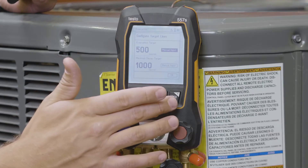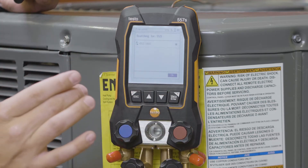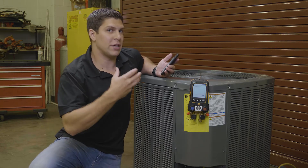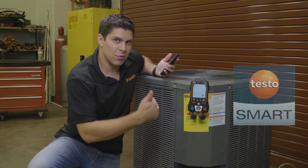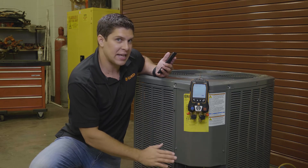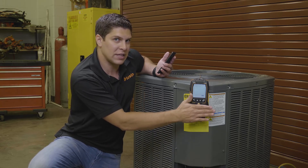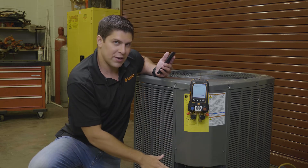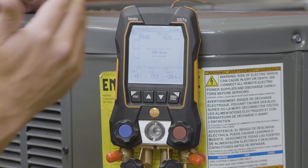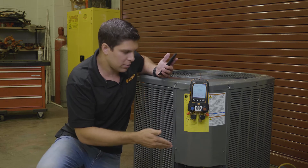So we're going to set our targets. It's going to be looking for the 552i, which you can purchase independently — it works with the other smart probes as well. You can run it with just the app or it will connect directly to the manifold. Using an external micron gauge is very beneficial because you are not messing up the manifold's internal pressure sensors. With the external gauge and your pump hooked up to the circuit, you get all your results right on the gauge.